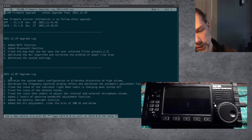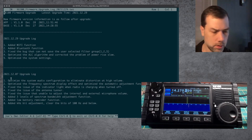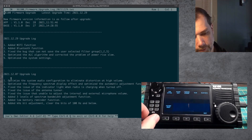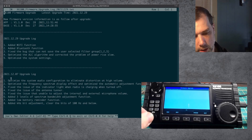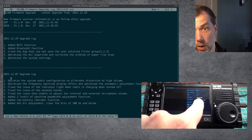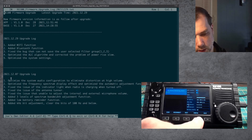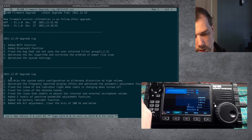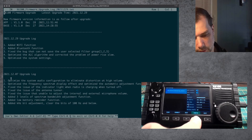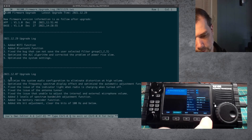Making noises — I caught it in the middle of doing something. It's much slower to boot up this time, maybe because Wi-Fi is on and it's trying to find an IP address. So we're at zero volts still. Go into system setting, time setting — no change there. Go into system info — no change there. Let's go into firmware upgrade. No WLAN. The password is now blanked out where before it was not. And we are connected, but that is not the proper IP address. Let's hit config, then edit to turn DHCP on, then disconnect and reconnect. DHCP went back off again. Config, edit — nice. Connect. And that IP address is still wrong.